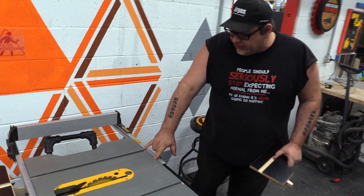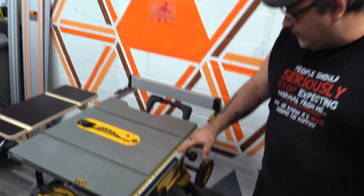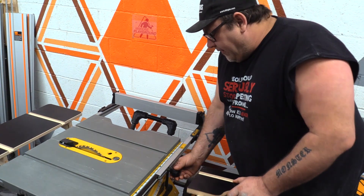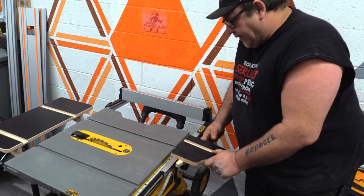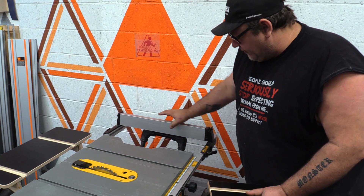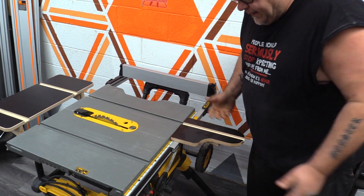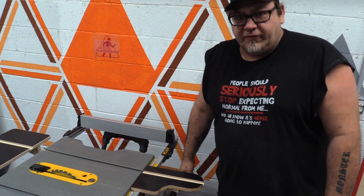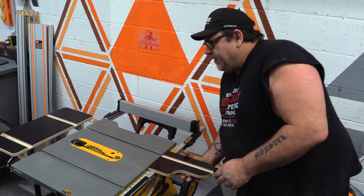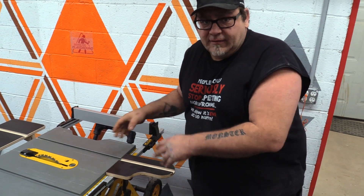First of all, you're going to need to drill two holes for each of the miter slot gauges. You can see these two holes right here — they are just over a quarter inch. This is designed to be set in with this bar in place, so you don't have to move it out of the way every time you use it. You can take this section off really easily. It just drops right in here and the clamp tightens down — that's super secure. We tried three or four different ways of doing this and this is easily the best method. You can pull the saw around with how tight these will get on the table saw itself.